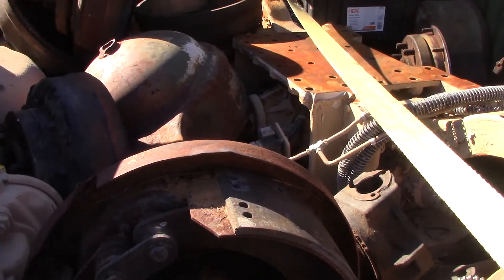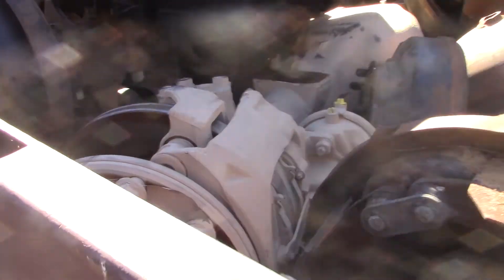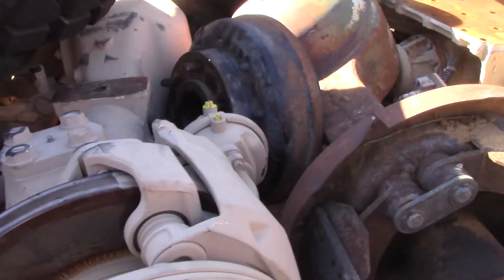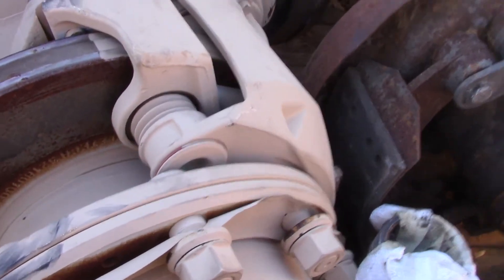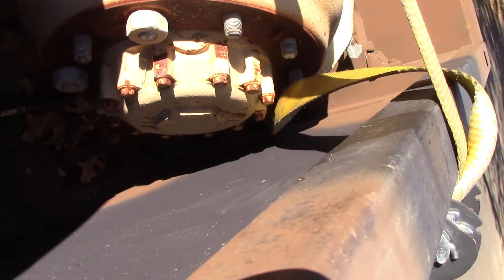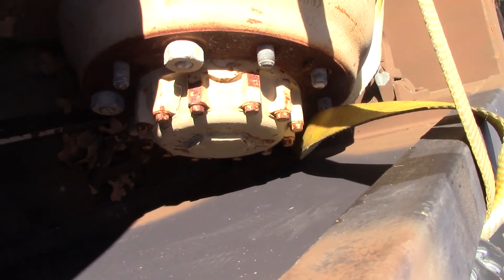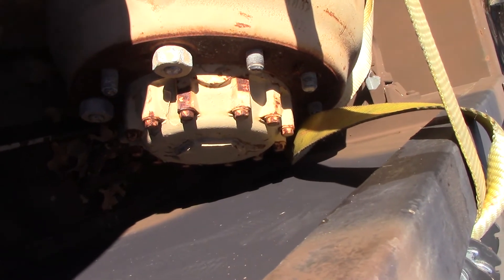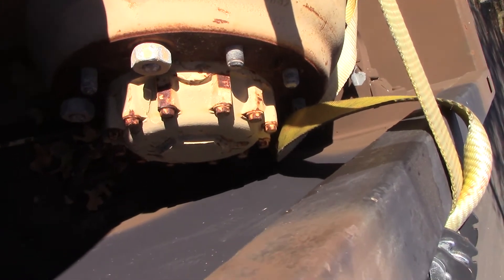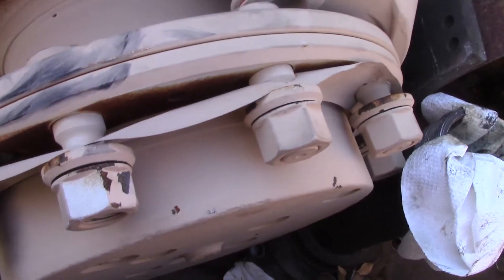There's a 5-ton axle. There's an Axletech 4000 — that's running those straight gear planetaries. Those Meritors right there, they're the ones that run the bevel gears, like Volvo patented in the 60s. That's those high-speed ones. This one runs those straight ones.